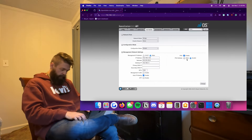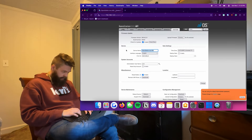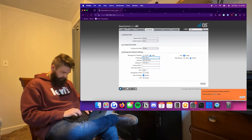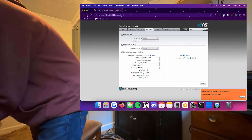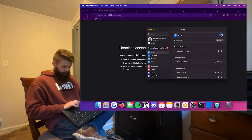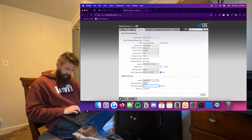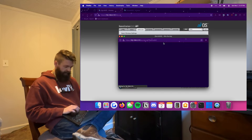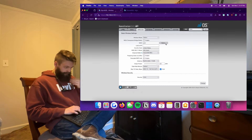I then set a static IP address for this NanoStation — I always recommend adding a DNS too, though I didn't do it here. I'm now into the second device, repeating the same exact steps I did for the first: giving it a unique name and a unique static IP address. After applying the new settings on both devices, it prompted me to change the admin password. I then go back to my first device and tell it to be an access point and broadcast the frequency between both devices. I create a unique SSID and pre-shared key, then go to the second device and tell it to be a station and start scanning for other access points.